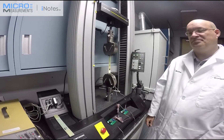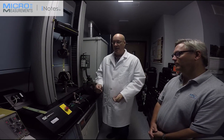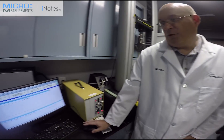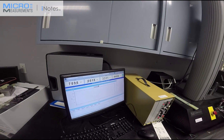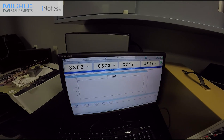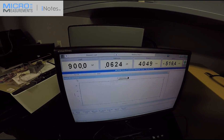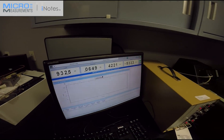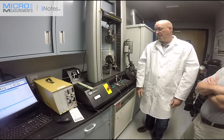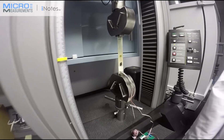We're expecting a Poisson's ratio in that range for this material — we've tested it many times, so we know roughly where it should be. If we get something totally different, we'd contact the manufacturer or customer. We'll run it up to about 1,000 pounds, which gives plenty of range to calculate the value. At 830 pounds we have almost 4,000 micro-strain axial and 500 transverse. The transverse is negative, which is normal — we're compressing the specimen as we're stretching it. At higher levels you'll start to see slight necking of the composite.